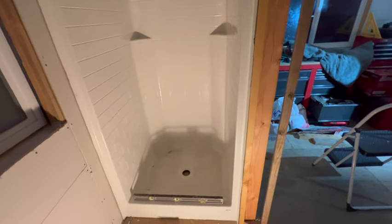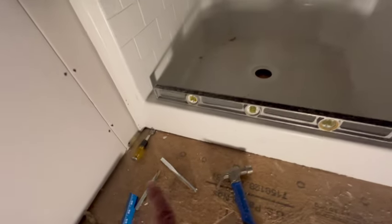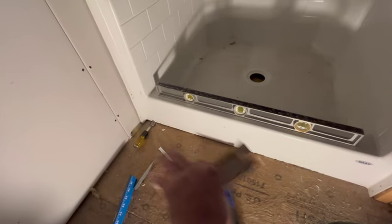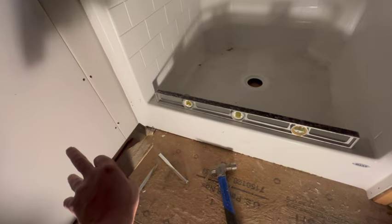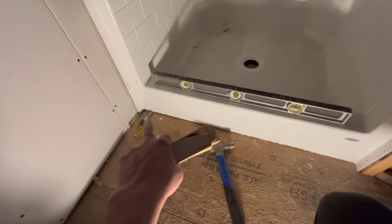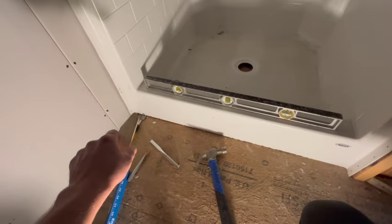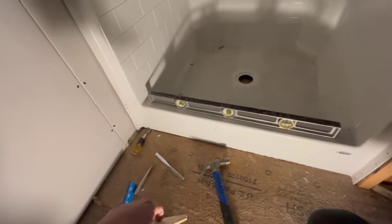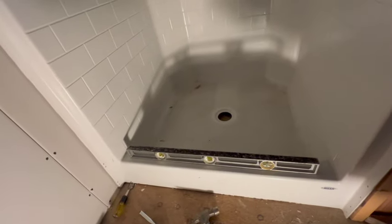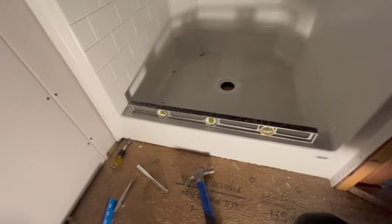Now that we got it sitting in there — it's not bolted in yet — we're trying to level it out. Like most mobile homes or single wides, especially the outer ends are always gonna be sagging a bit because of the weight from the walls and the roof compared to the center of the house where the metal beams are. So we're putting a shim in here — got it hammered up with a chisel — and we'll put a shim in the front, maybe one or two, and try to get some in the back. In the end I'm gonna shove a bunch of mortar underneath in the center spot to strengthen it up and keep it level.